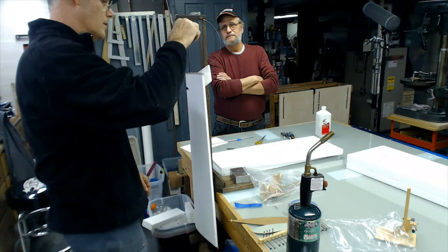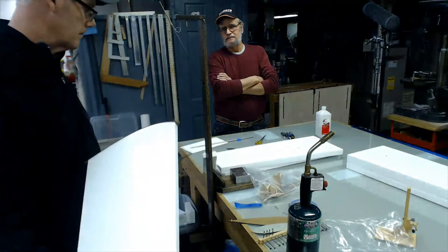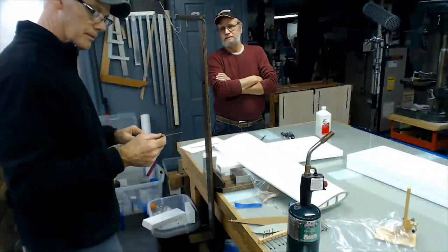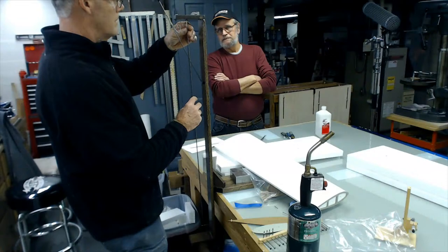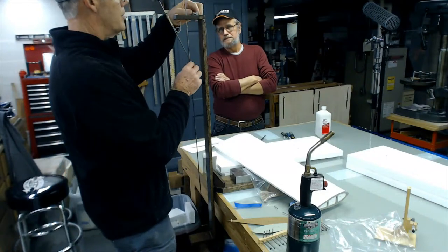One of the things I do with this wire, I take polishing compound, and I polish this thing. It's music wire. You could probably use drill rod, it might be better, but I take polishing compound and I slick this thing up. Mm-hmm. And it probably wouldn't hurt to lap that brass bushing out a little bit.